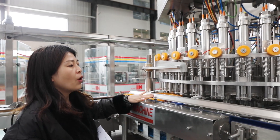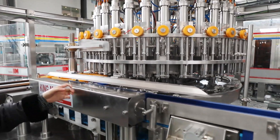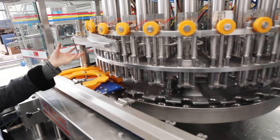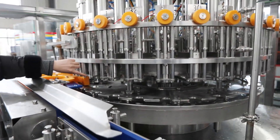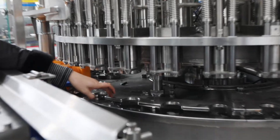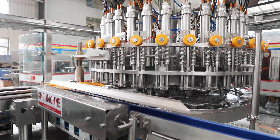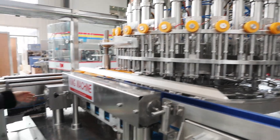When you need to change the can size, you need to change the filling screw and also the plastic star wheels. You also need to lift up the complete filling head system — we have six bearings to lift it up — and change the relevant parts. This machine also has a counting system at the bottom to track how many cans have been produced in total. There is also a lubrication system here.